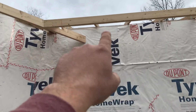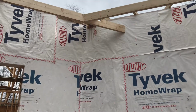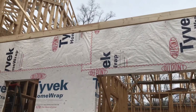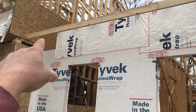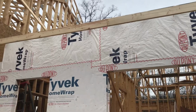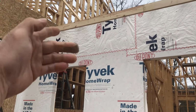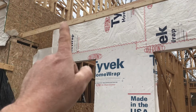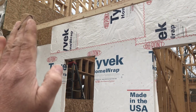And then when you cut this one, cut that at a 45 miter, seats it right in, plumb them, 3 nails in the front, super tight. And what we usually do is once we measure our 22.5 out and run a line, you chalk it, cut the tails. And then what I do is when you put the board up physically, we put it up there, we plane, you take your speed square and just plane down to where by the time it planes and touches the top of the fascia, you're a 1/4 inch in from the face of the fascia still. Seems to work pretty good.